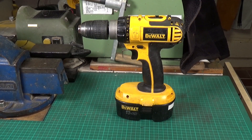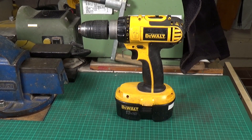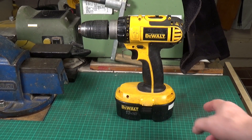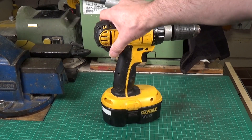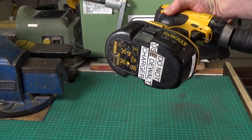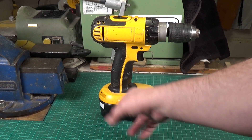At the time these things used NiCad batteries, which were borderline useless. So I bought a completely dead battery — paid about four pounds for it — gutted it, took all the NiCads out, and put a couple of LiPo cells in, which is why it's got 'LiPo' written all over it and 'do not use DeWalt charger' on the bottom. It's not 18 volts — about 15 when fully charged — but that's more than enough. Because they're LiPos, they weigh about half as much as the NiCads and produce loads of current, so it just lasts forever on one charge.